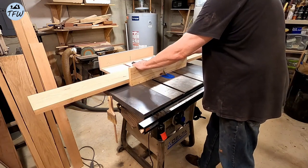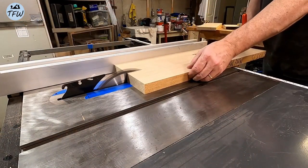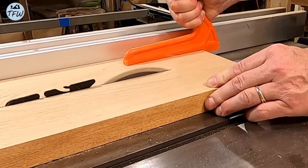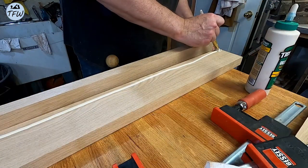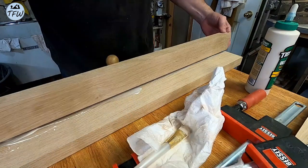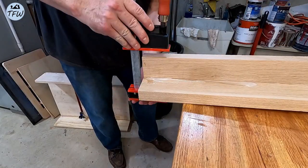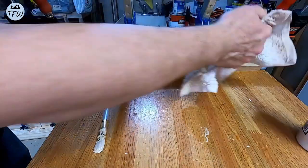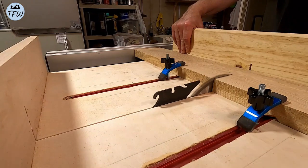This is some extra five-quarter white oak lumber that I purchased for the legs, and all of these pieces are going to have to be cut. Ultimately the legs are going to be in an L-shape, very similar to what I did for the Limbert rocker and also a sofa table that we did a little earlier this year. These are going to be just butt-jointed, much like the Limbert rocker, and I'm going to add some dowels to strengthen these after the glue dries. With a little soapy water, I try to get as much glue out of the way as possible.